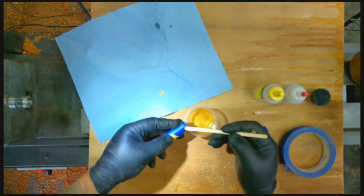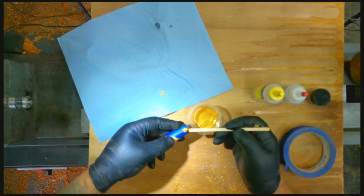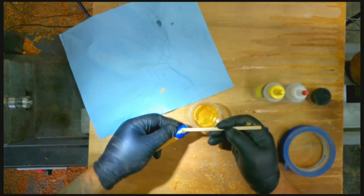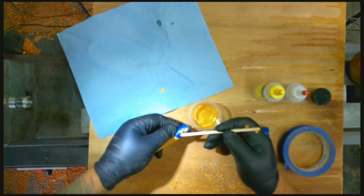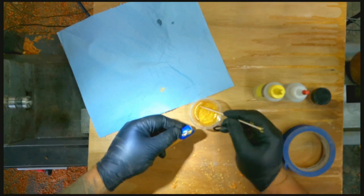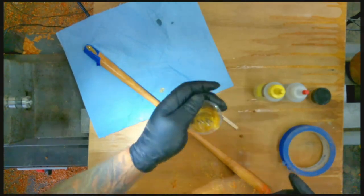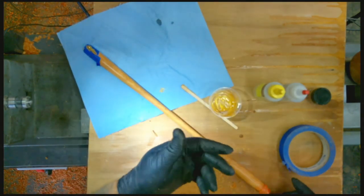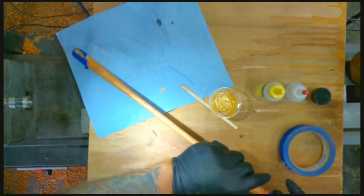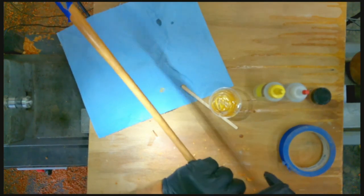And again, that will be hand sanded. Won't get to see that at the end of this video. We'll go ahead and make sure that we get that epoxy down in there. Really work it in. A lot of void. So that's one thing I think you could take away from this kit, if PSI even still sells it. I don't even know if it's still available, is that you've got quite a bit of a void in the top there. So if you can chase the threads, that most likely would be the best solution.